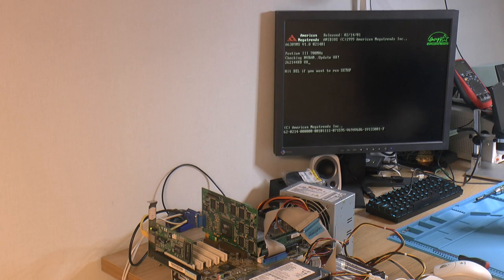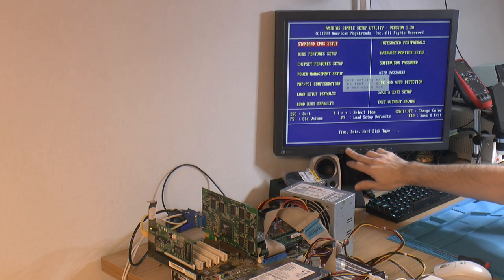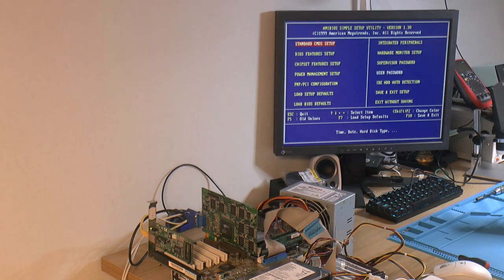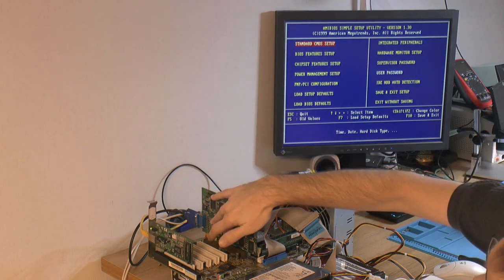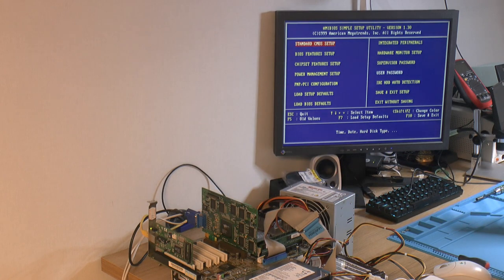So go into the BIOS here real quick. And it looks artifact free. The postcodes are what I expect from what I had before. I got 2 reds, 2 greens now. And yeah, so it seems to work. Before my test, it's just that the RAMDAC didn't work. The crystal was missing, and there was obviously a lot of corrosion on the VGA connector, but the crystal was the fault there, and the last fault on the card that we know about right now.